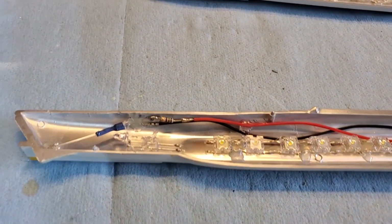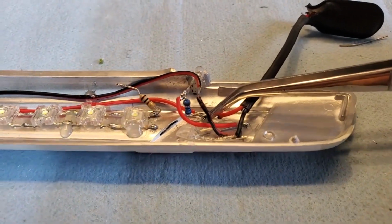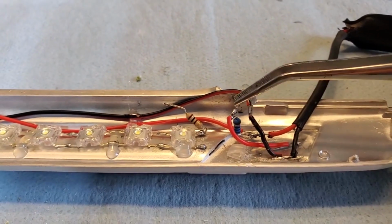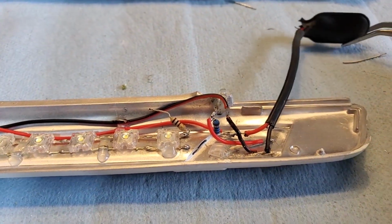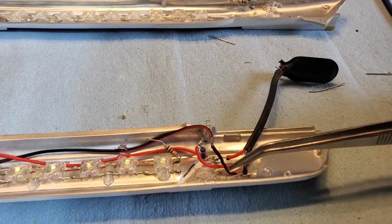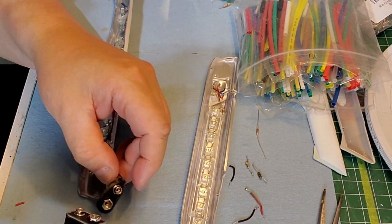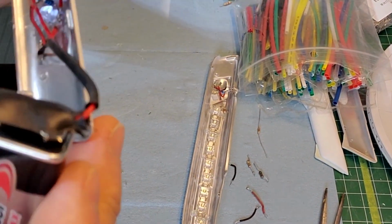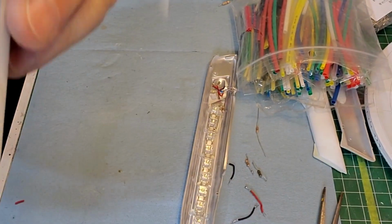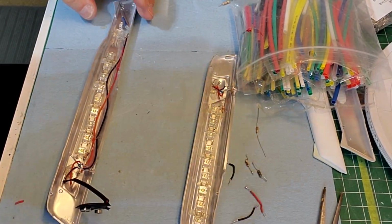Okay, now I got over here on the yellow, I got a 68 ohm resistor, which goes all the way over here to tie in with these lights in here on the inbound source, power source coming in. Not on this end, but on this end. Otherwise, it would be too dim because it'll have 2 resistors on it. Instead, it's only got the one. Still got the 1K on here to reduce the lighting on these 2 here. Let's do a quick lighting test. Okay, good. Those 2 lit up nice. And then we got the yellow here on the end. Got the little yellow thrusters here. So they look good. Alright. Perfect.